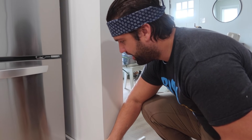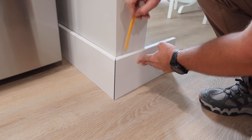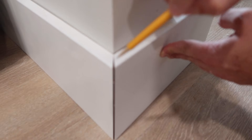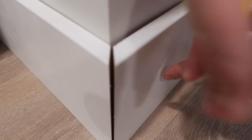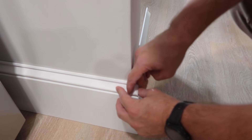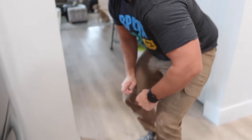With all these walls being out of whack, you guys are definitely going to see it. This is not a perfect 45 here, so my miter's open. What I'll do is adjust this cut. You can take this gap at the largest point, transfer it onto the back — whatever that gap is, bring it out, mark it, bring it down. You're going to cut from nothing to that mark and that should close the miter up. There is still a little opening, but that's what they make caulk for. That's how you close up a miter in case it's open.